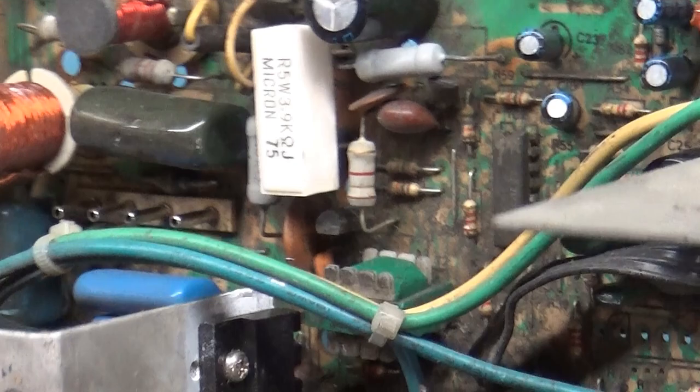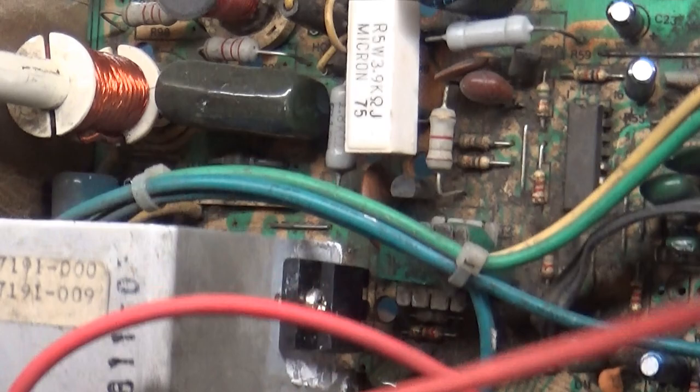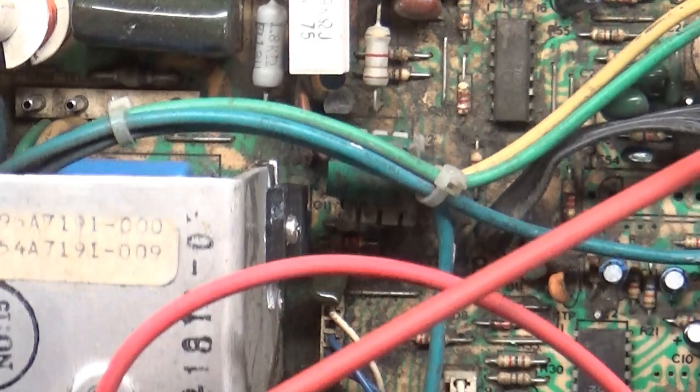It's missing the insulator. I don't think it needs an insulator. I don't think this particular style needs insulators. Initial inspection... That's about it. Flyback damaged, HOT odd, and R103 odd. So,